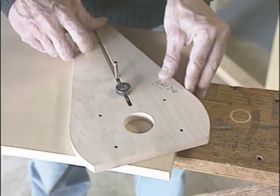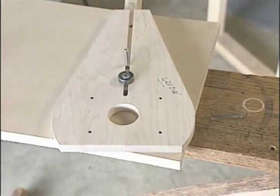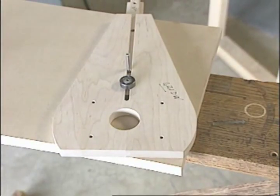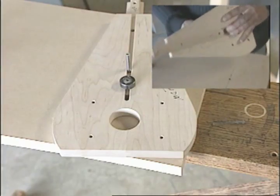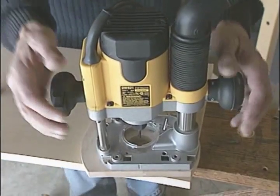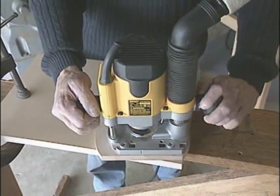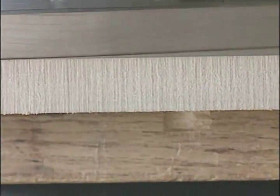Now here's my simple jig for making circle or hole templates. It's just a maple router base that pivots on a 1/4 inch pin that you set into a 1/4 inch hole you've drilled into your template stock. Now that pin is held in a sliding arm that allows you to set the precise radius you need. A plunger is the tool of choice because you'll want to cut down in stages. Spin the whole affair 360 degrees to make sure you can do it.